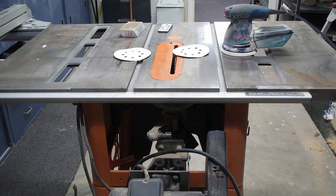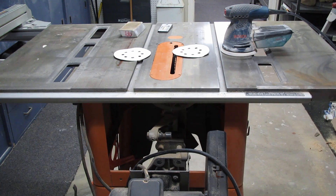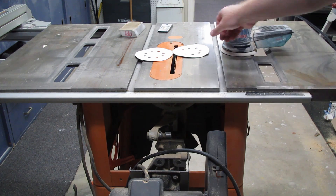Good day guys and girls. Today we are going to give a little TLC to this table saw. I got it from a friend who didn't really take care of it. As you can see there are some rust spots — it's very rough. There's also a little bit of glue here from a glue-up that spilled over. We're going to sand it and then protect it with some paste wax so everything slides nice and easy and is protected from further rust.